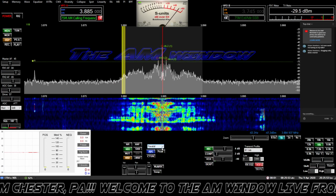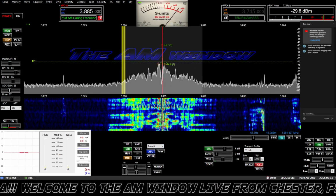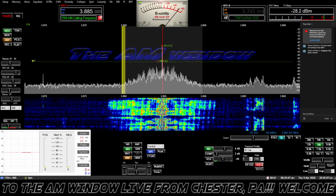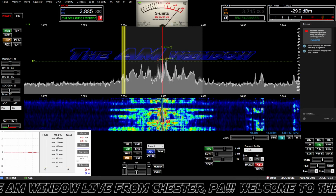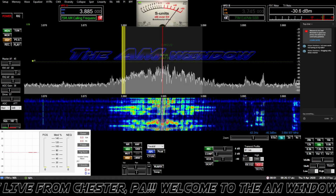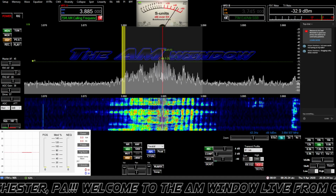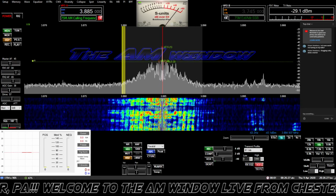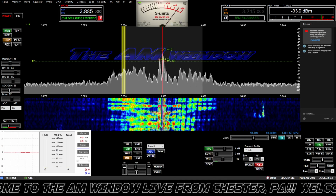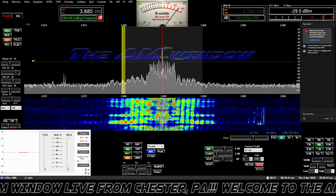They all have 115 primaries, and then there's a whole slew of secondary voltages. So you find 2 voltages that work. In my case, 55 volts and 800 volts. The other thing about Antecs is there are 2 sets of parallel windings in the secondary. So I've got the 55 volt windings in parallel. That feeds through, so I turn that transformer around backwards. I'm using the secondary as a primary. The other side ties right into the 115 of the other transformer. That one's not turned around backwards, in series, and the output of that is the 2 800 volt windings in series making 1600 volts. So you get your 55 volt primary, 1600 volt secondary, and the turns ratio is perfect for the Viking 2.